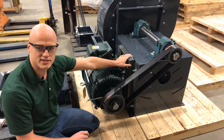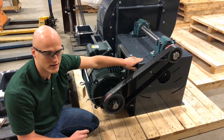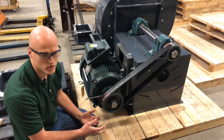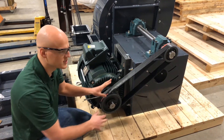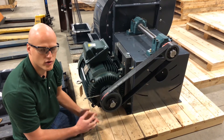Your motor's right here and it's mounted to a slide base, so your motor and slide base mount to the side of the fan. These are all the components that are needed to make up your Arrangement 9 fan. When this is completed, we'll put guards around these belts and a guard over this shaft, and you'll have your complete Arrangement 9 done.